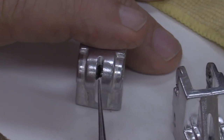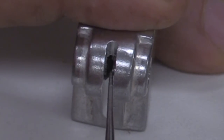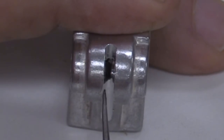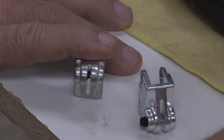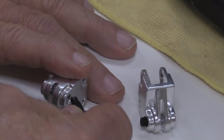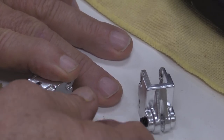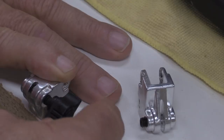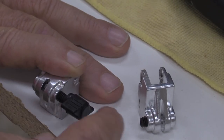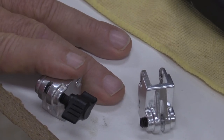What I look for is for the screw to stick through into the opening, into the blade path, by about a 32nd of an inch. You can probably see that right there. What that then permits you to do is, using your blade anvil, as I refer to it, a screw clamp, you screw that in place, and you loosen that about three turns in order to slip a blade in, then you tighten it down. Most scrollers are familiar with doing that.